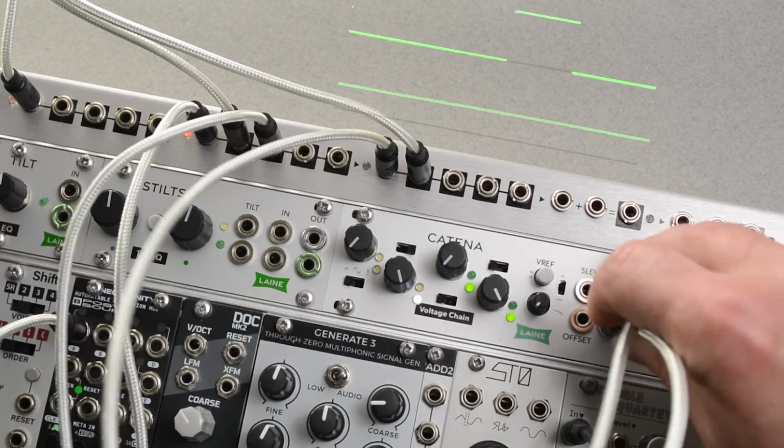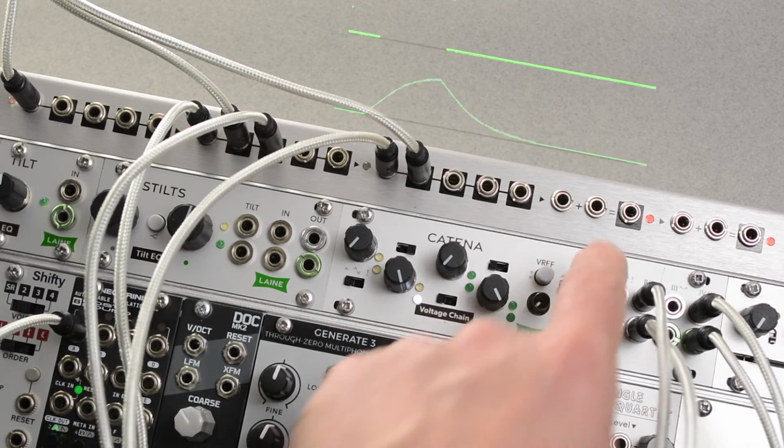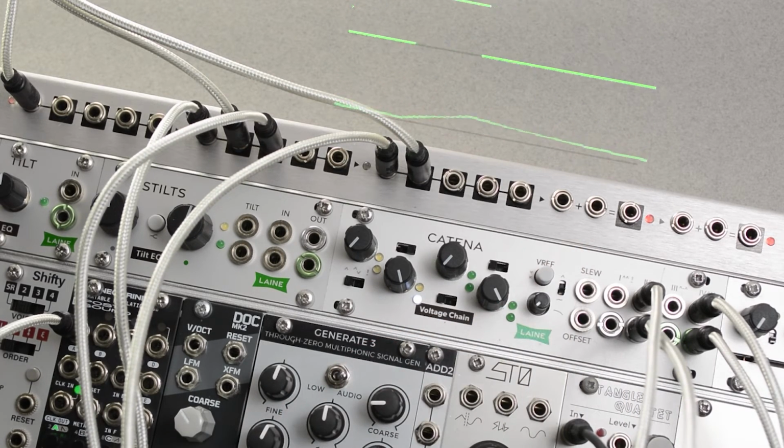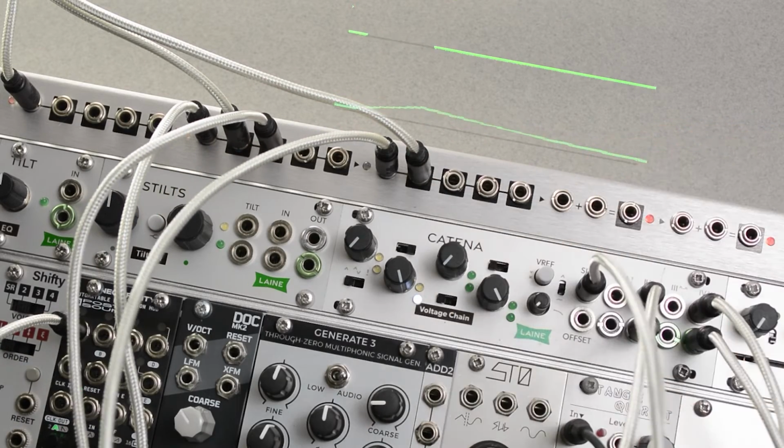The slew circuit on channel 2 is much looser and slower to respond compared to channel 1, making it more suited to tidal modulation or glide control on synths and instruments. The attack curve is lengthened depending on the slew control switch and has a similar CV response, only transposed to these longer attack and decay settings.